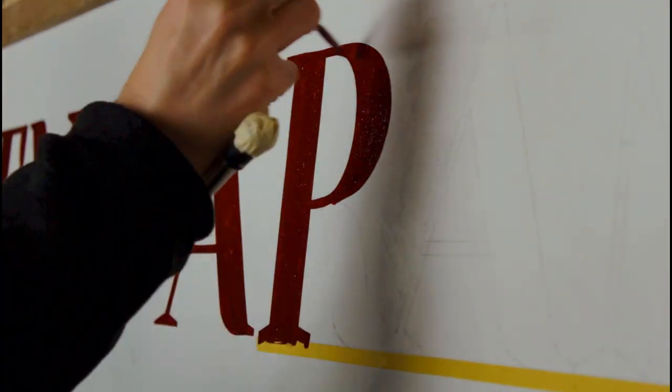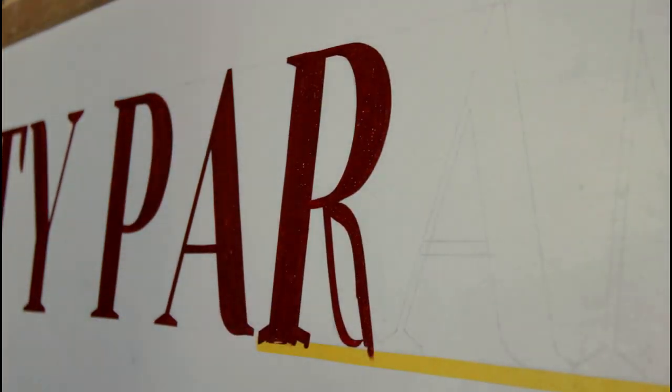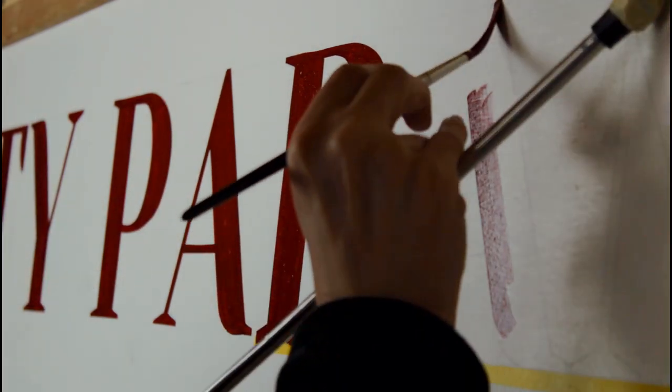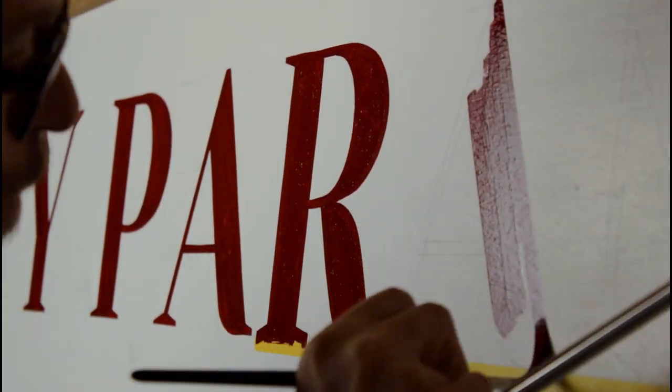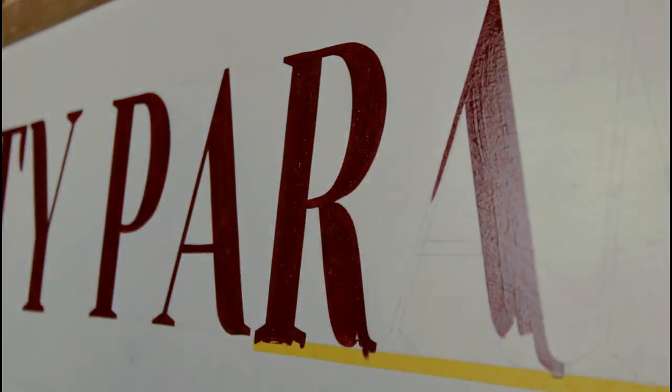There are a few stages that I didn't show in the video, such as sealing the outer frame, because although it's pressure treated, it did need to be sealed as well. And also I did some sealing inside the cut-ins of the frame itself that the panel slid into. You'll want to remember to do that as well, because you want to make sure this lasts outside.